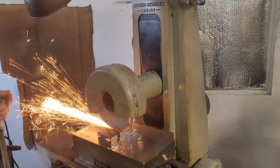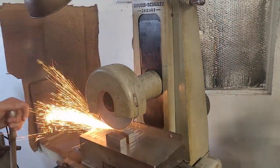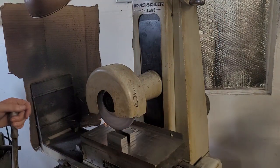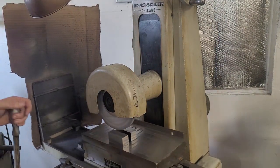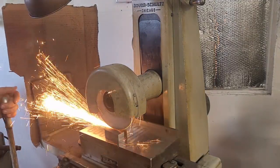So this is sort of, people call it peel grinding because you're peeling away the top of the surface. You're only cutting with one corner of the wheel. If you're familiar with how a train wheel basically wears into a cone, that's what these wheels do.